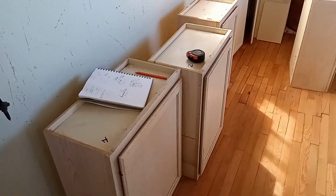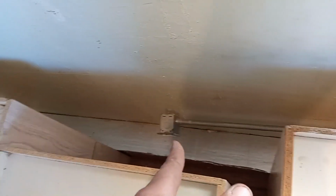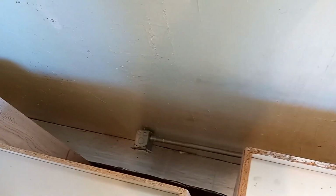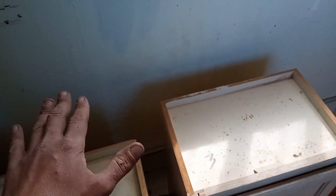These are upper cabinets, so we need to raise them up a little bit and also get around this wheel well back here. What's convenient is that wheel well, with the foam on it, is exactly 5.5 inches tall, which is the size of a 2x6. So I got some 2x6s to build this framing. It's also very conveniently going to put our finished countertop height at approximately 36 inches, which is pretty standard height.